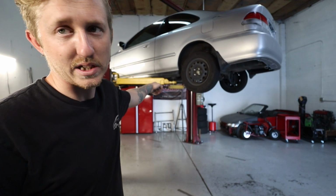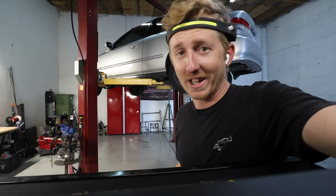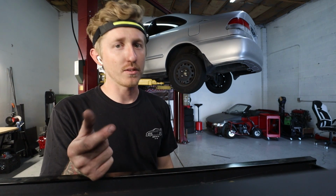Yeah, I'm going to try and break these things free and get a head start on this stuff, so I will catch you guys in a few minutes, hopefully, if this doesn't take too long. Okay, I just tried. There's no way in hell these bolts are coming loose, and I don't have a torch. So what I'm going to have to do is cut the bolts off, and hopefully the flanges themselves even separate, because I have new bolts, I can just replace the bolts.